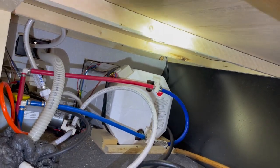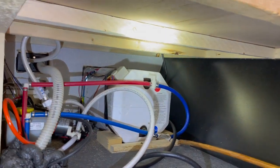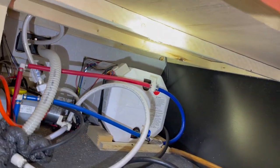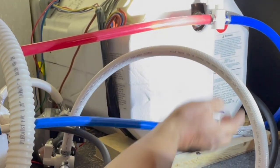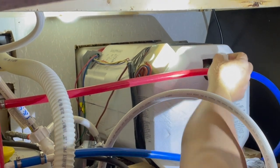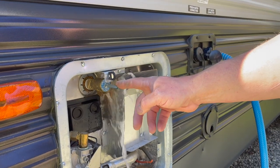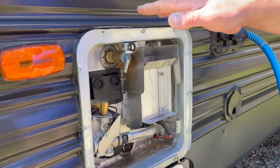Then we'll go and do the valves on the back of the water heater to allow the water to fill the tank. If you look under there at the water heater, we've got two valves — some setups are three valves, and I've even seen setups where it's just one valve. Right now those valves are pointing in the direction of the hose, which tells me it's in bypass mode. So we're going to turn those valves so they're pointing at the water heater, and then the cold water will be filling the tank. After we close the pressure relief valve, the water will be coming out the top of the tank when hot water is called for.